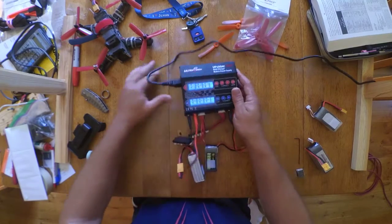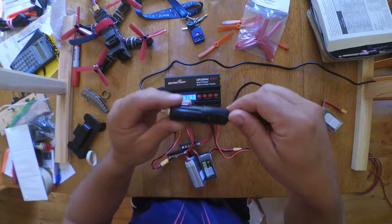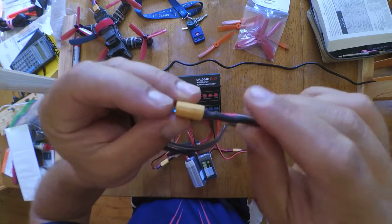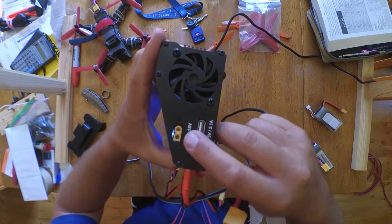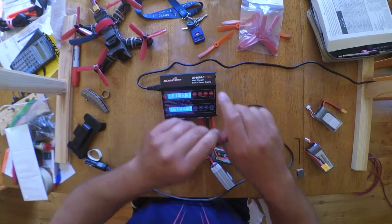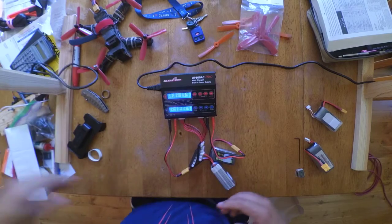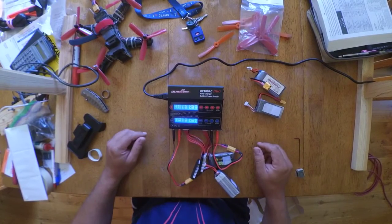That's a quick overview — I like this charger. For field use, I went to Walmart, got a plug, used a chunk of extension cord, positive to positive, negative to negative, and plug it into the side DC input. You can run it right off your vehicle's cigarette lighter — no battery clips needed. It works fine, nothing gets hot. You can run 10 amps through this and a cigarette lighter handles 10 amps, so you won't overheat anything. Please like and subscribe, have a great day.